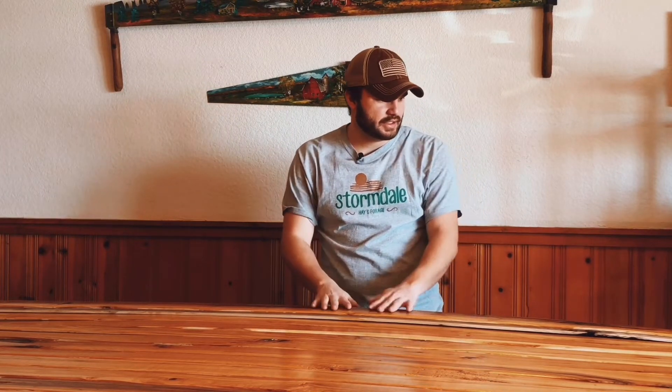Second coat of poly applied — now let's see if we need a third coat. The first thing I check is what the boards feel like. If they're pretty smooth and glossy without too much roughness, they're getting close to ready. The second thing is the gloss — since we used satin, we don't want a whole lot of gloss, and the more coats you put on, the more gloss you'll have. For us, the boards are smooth and have just enough gloss, so we do not need a third coat. If you want a third coat, just repeat the same steps. When you're finally done with your last coat of poly, do not sand, because that will create scuffs. When you're done with your last coat, the boards are ready to go on the wall.